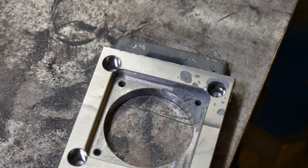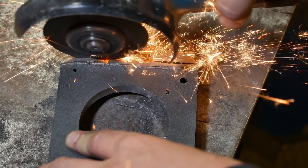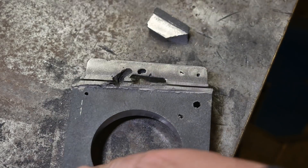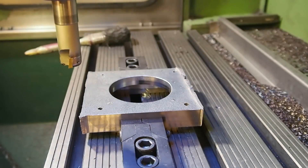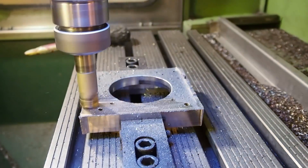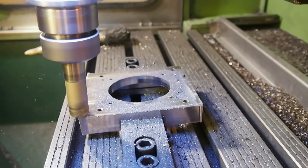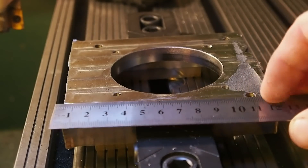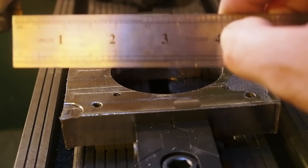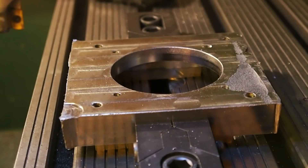When the motor goes in, it'll cover a lot of the ugliness, so I don't think I'll recast this — I'll probably just use it as is. Next up, goodbye clamping ears. Those bits can go back in the pot. I think the problem I made here was I just underestimated how much I have to take off. I thought I was closer to the edge than I was. No harm done. I checked the insert — it didn't get chipped out. I just had to reset the part in the clamps and repost the file to move this right off the edge of the work before starting.